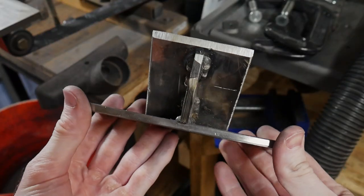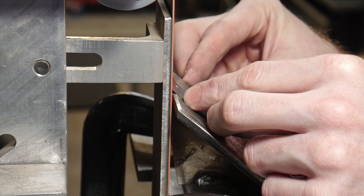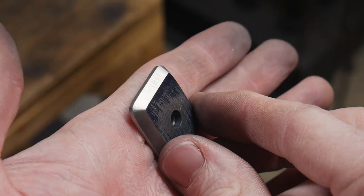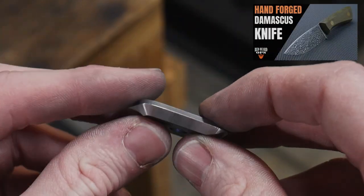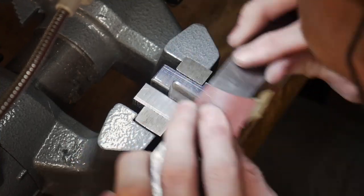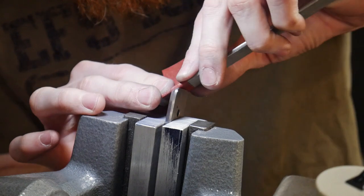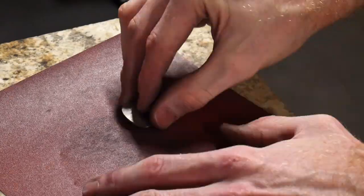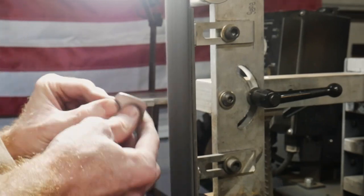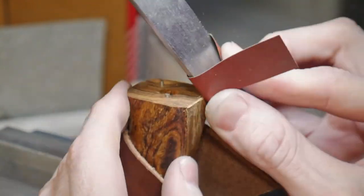I scribe a line all the way around the pommel cap because I will be putting a 45 degree chamfer around the entire pommel cap in the direction of the end of the finial. My 45 degree angle jig came in handy once again — I use it a lot on my full scales and also used it around the entire handle scales on my recent damascus full tang knife. I then take the entire pommel cap up to a 320 grit hand sanded finish and hit it with the Scotch-Brite belt for that nice milky satin finish. I like the way all the satin finishes turned out on these fittings, though you could certainly bring them up to a mirror polish if you preferred that look.